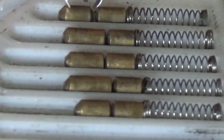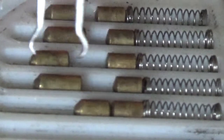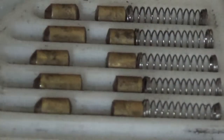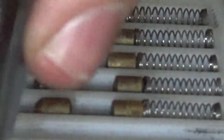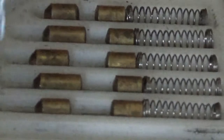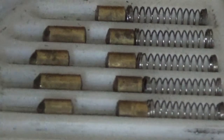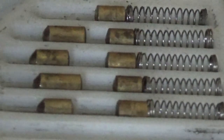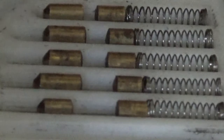So this pin. Okay, what I'm going to do is I'm going to try and make this better. So take that key pin, take that one away. It's a bit better anyhow. This one I'll replace. The shear line on that is too big for my liking. Give it this one here. And yeah, the other key pins I'll leave the same.